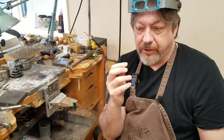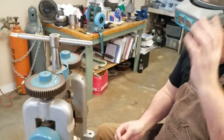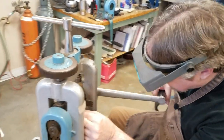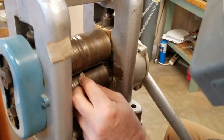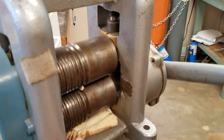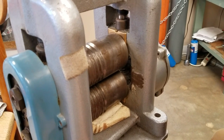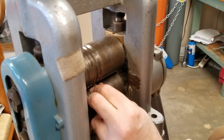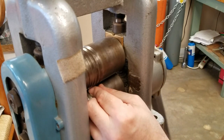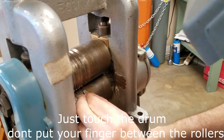Really the best use here is to go to the rolling mill and see how this would work. We're just going to start feeding this through. Open the mill up until it just starts to grab it and pull it through. I like to push it through part of the way, feel the pressure come off the handle, then pull it back. Then we'll turn it 90 degrees and pull it back. Just do it a little bit at a time.